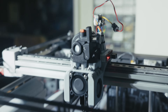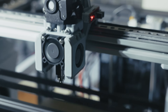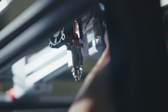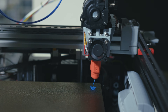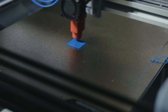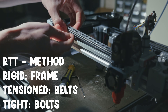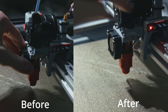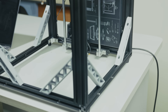Now that we've installed the new hotend components, the stock fans aren't going to reach so I'm just going to remove them to save weight. The melt zone is actually crazy — it's more like 40 millimeters. I'm going to give it the extrude command — yes, first time! Using the RTT method — a checklist to make sure your machine is Rigid, Tensioned, and Tight — I found rigidity was lacking. I fixed that with the stock linear rail and some super struts for bed support, plus printed frame braces for even more rigidity.